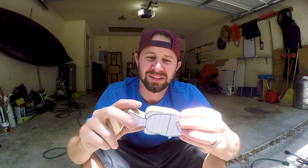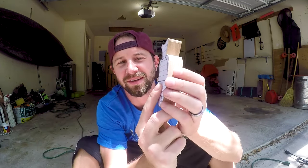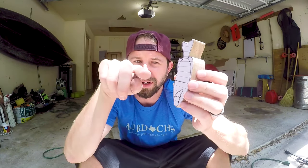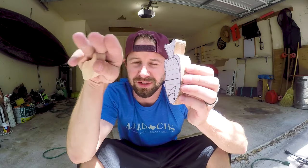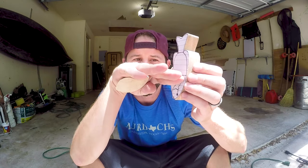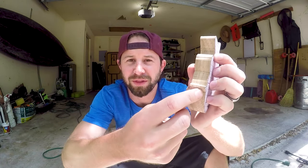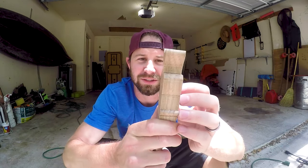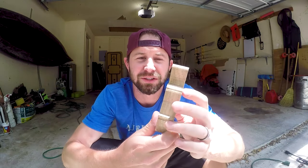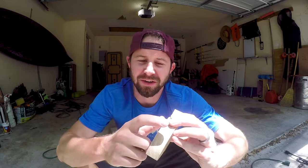The way I do it is I actually take a clamp and clamp the angle. I cut a board at 30 degrees and then I rest my saw on that angle and when I cut through it just constantly stays on that angle. Cuts down, go all the way through — leave about a quarter of an inch, maybe a sixteenth of an inch, just leave that amount connected in the middle.